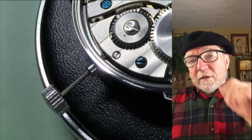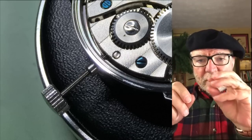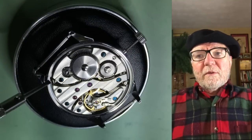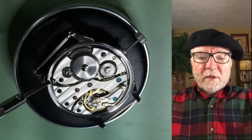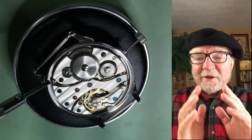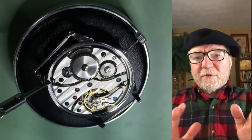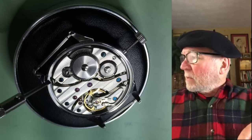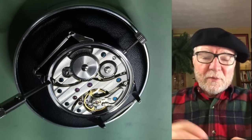You might have to shake or rattle the stem a little to get it out. Don't force it; if it doesn't come out, loosen the screw a little more and pull it out. Then you put the movement inside the case and put the stem back in. The good thing is you can't put it in the wrong direction — the stem only goes into the hole for the keyless works, so everything ends up in the right place.